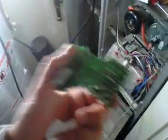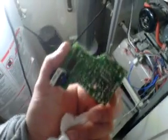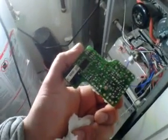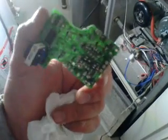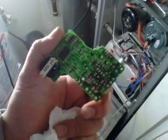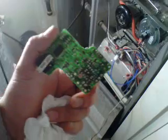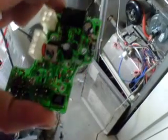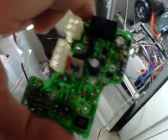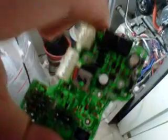I could probably replace some capacitors and stuff, but I don't know how this circuit actually works. Without that information, I can't properly diagnose what this board does, how it works — I don't have a schematic diagram. So if repairing the through-hole devices doesn't work or is still intermittent, I may give another shot at repairing the SMD devices, or I may just end up replacing the smart valve. But I'm pretty confident, just looking at the solder and the way this board was made, that what I'm doing today will probably fix 90% of the issues with these boards out there on these smart valves.